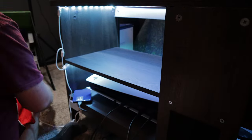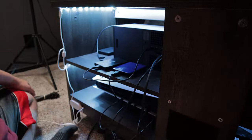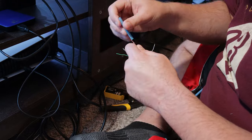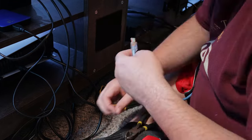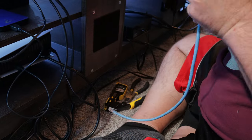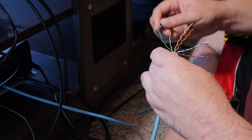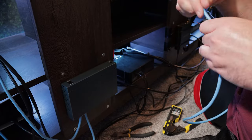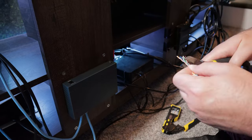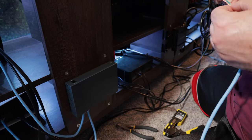Normally when things are right up against the wall, you have very limited access to get back there and cable manage the way you want to do it. While it's not perfect, it's good enough and I don't have to worry about fire hazards or big bunches of cables, or if I need to swap something out it should be relatively easy. I also wanted to make custom ethernet cables for all seven components — so 14 ends total. Not having made batches of ethernet cables in a long time, my fingers were definitely sore from straightening out all the cable ends to fit in the RJ45 connectors. Definitely take a break — and if you have any tips for straightening those cables out other than using the sleeve jacket, let me know in the comment section below.